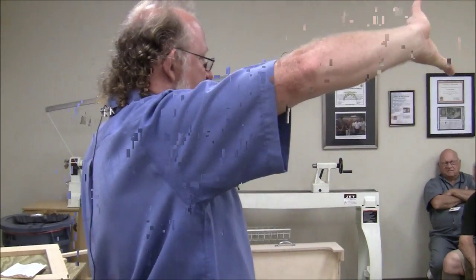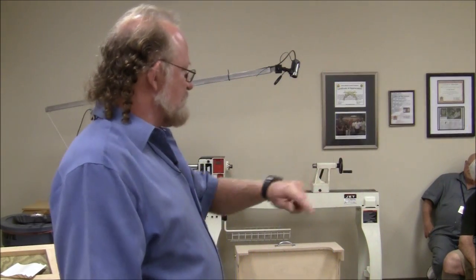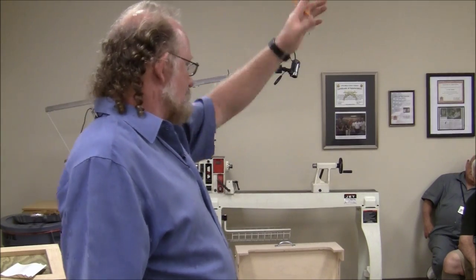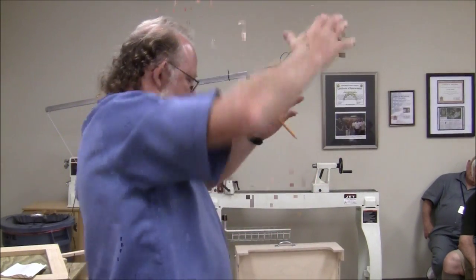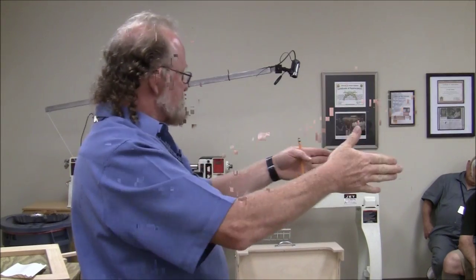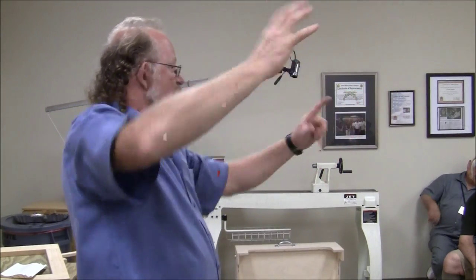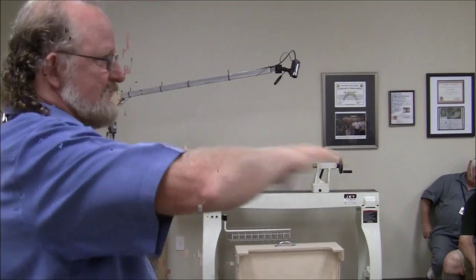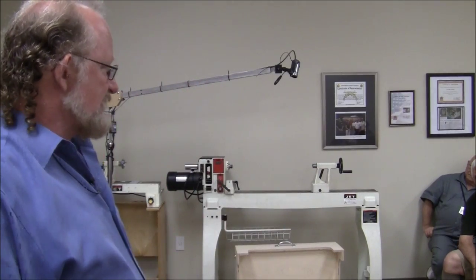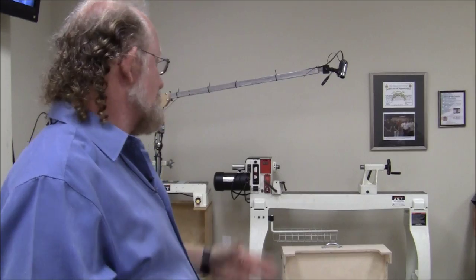If you're going to do that, you've got to make the transition into the level — you can't just let it come down. It's like going up a rake on the outside. What we call in New York a bird box — you come down on the outside molding, then you've got a bird box where it flattens out. If you come down that rake you just can't really make a miter and go off in the other direction. Then you cut that trim — usually just making that outside trim out of one-by-two or a shingle mold. You kind of muddle it because it's up in the air and nobody sees it. That rake cut is not going to be the same length as your level cut, so you have to make that transition — that's why the bird box is put in there to begin with.